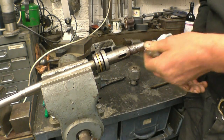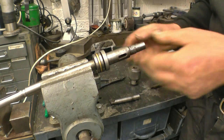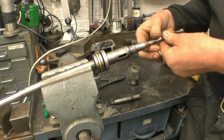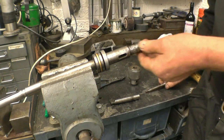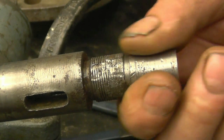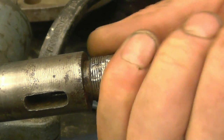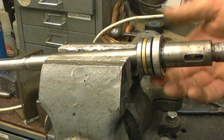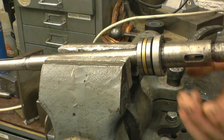It is quite badly damaged. I think once I'm welding it I might as well carry on, build it up with weld as well and remachine it. I have got a number one Morse taper reamer so I can clean up the bore in there. I'll bring the camera a little bit closer so I can see what's actually happened to it. As you can see, it's a proper mess. The lad bought the drill at a jumble, without the chuck on it — there was some tape wrapped around there, so he didn't know it was that damaged until he got it home. That band would probably be alright to leave on to weld it up, but I think I will take it off if it will come off easily, then I can chuck on this part here.